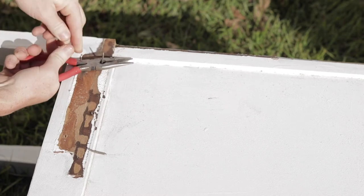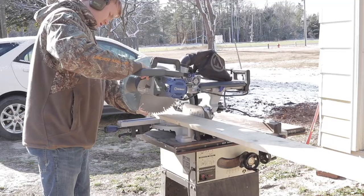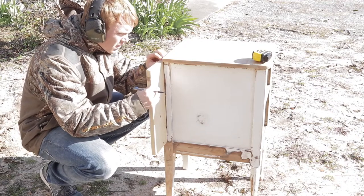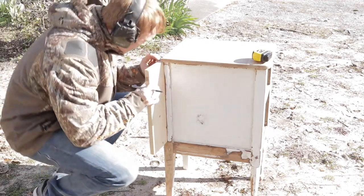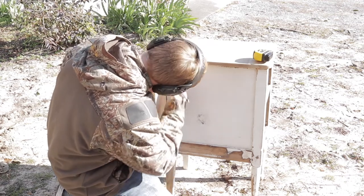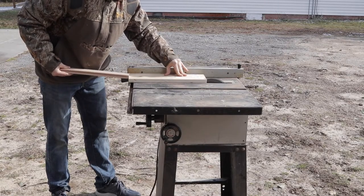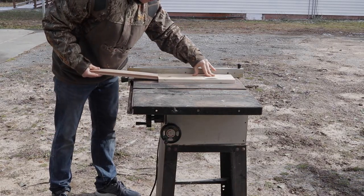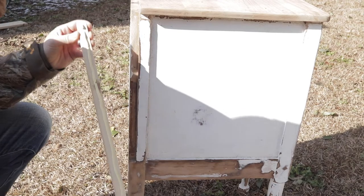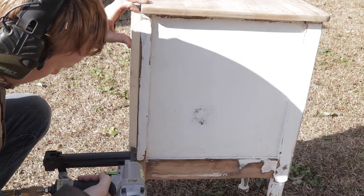So we're going to show you how we made a couple of wooden pieces to fill those gaps so that we didn't have an opening. My husband just took his chop saw and cut a couple of pieces of scrap wood that we had laying around — cut off a section that was the length of the hole we needed to fill. Rather than measuring with a ruler, he just laid the piece of wood up to the hole and traced it to get a more precise estimate, then cut it with his table saw. Once those pieces were cut, he put a little bit of glue on them and tacked them in place while the glue dried with a nail gun.